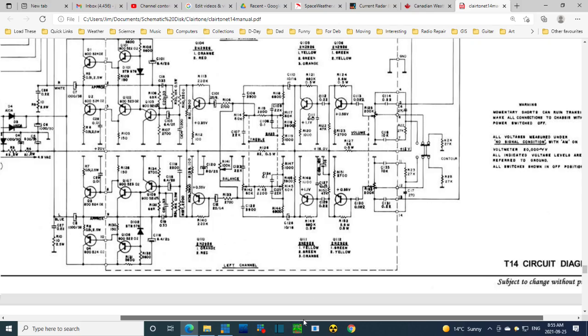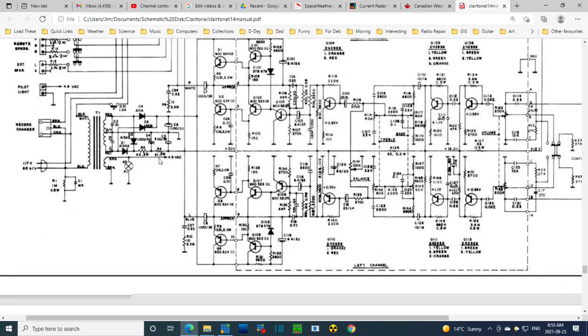You know, another way, of course, is to put these two output voltages, the power supply voltages, on my scope and look at the hum. The difficulty with that is we don't really know what hum level is a problem offhand. I mean, sometimes it's obvious when you do that. Sometimes not. Another thing I can do is temporary paralleling.